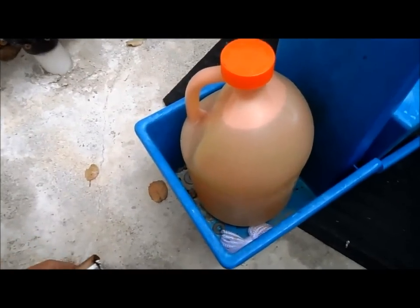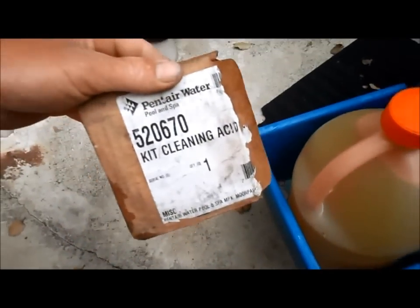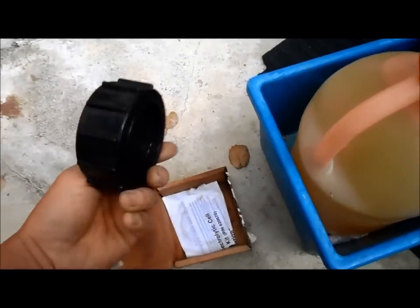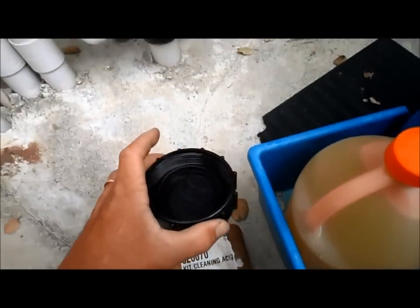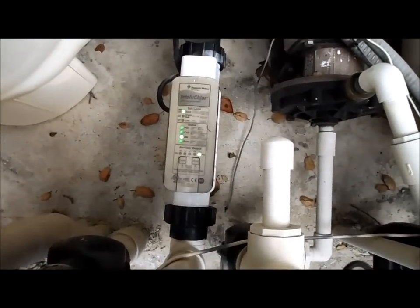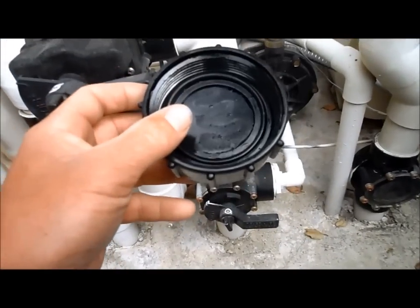You're going to need a gallon of muriatic acid. I never put it directly on the ground because it will actually stain the cement. You're going to need the 520670 kit for cleaning, and you can pick it up at your pool store. It's basically just a bottom piece where you set the cell in with a little o-ring to keep the water in, and you set it on the ground and put the cell right into it. You don't want to immerse this particular cell in a bucket of water because it's all electronic — you'll definitely damage it. You just need to get that adapter at your pool store to clean it, and I'll show you how it hooks up right now.